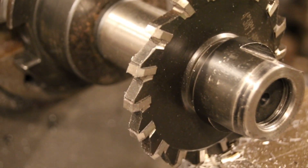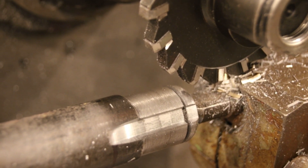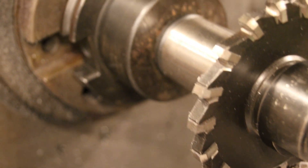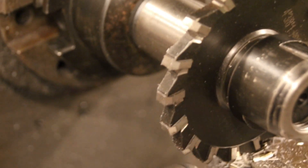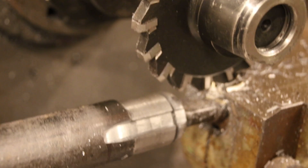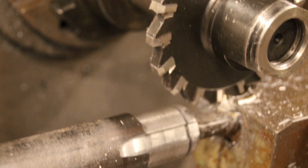That's the wheel I had ground. When you hear this going around you're going to hear it kind of ticking a little bit, like the spindle's running out — which it's not, the spindle is dead zero. There is one tooth on this that's just a hair longer than the others, and that screwed me up on my trial piece because I didn't realize I had a high tooth, and it messed up my depth.